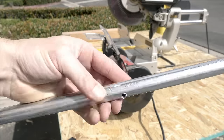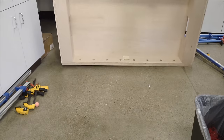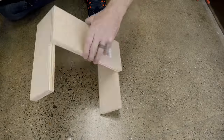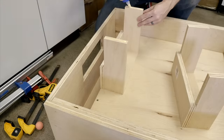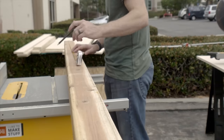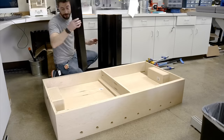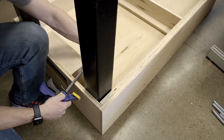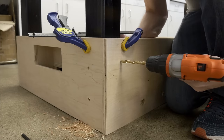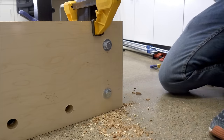The bottom side of these holes is pretty sharp, so I used a grinder to smooth it all out. While I was finishing these rods, the glue had dried on the table, so I took off the clamps and flipped it over. Now it was time to add the goal boxes underneath. These were made from four pieces of plywood cut down and just nailed together. These are completely hidden and are really just on the inside to stop the ball from hitting the floor. I added some glue and slid them right into place. Then I cut down the legs — 4x4s cut to length with the miter saw. We cut four pieces the exact same size and then painted them black with a couple of coats. After setting these in place, I used some clamps to hold them in the corner from both directions before drilling the holes through the outside panel and into the leg. Note that if you drill holes in the same position on both sides of the corner, the bolts will run into each other, so either use shorter bolts or space out the holes differently.